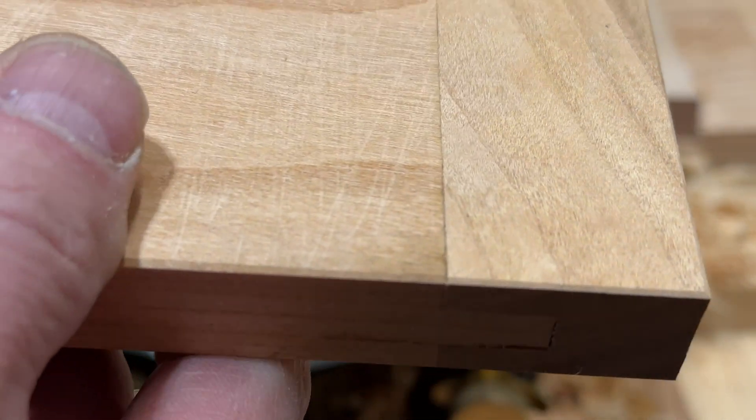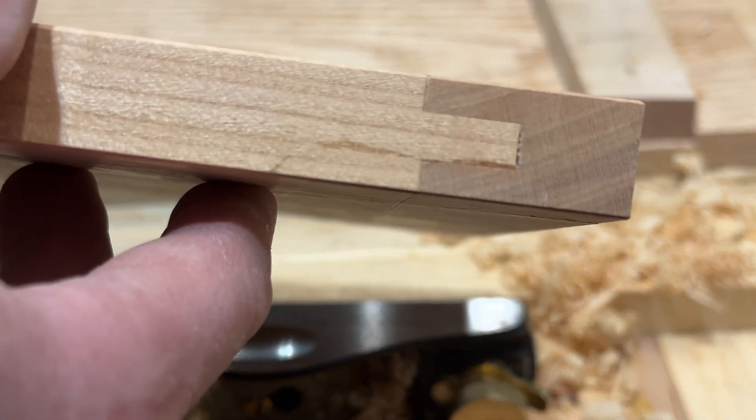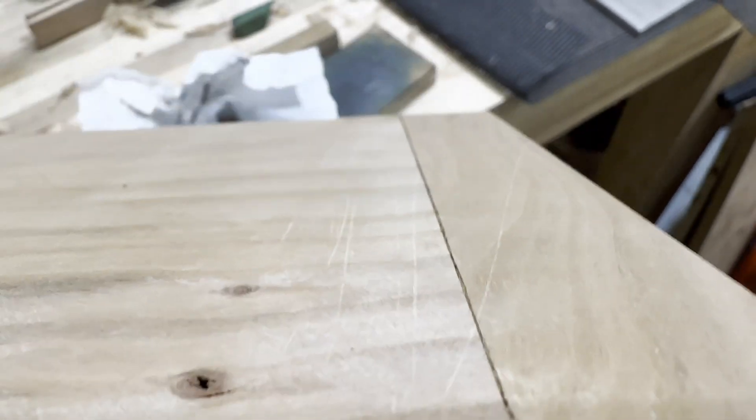This is a great fit, and it's just because the tenon and mortise were very square, and the tenon wasn't forcing the mortise open. But the other side wasn't a square fit, and it forced a little gap open. It's not structural, but it didn't fit as well as I'd like.